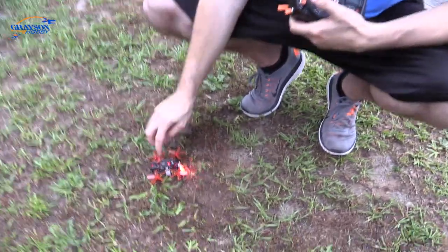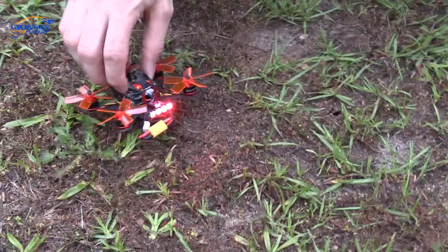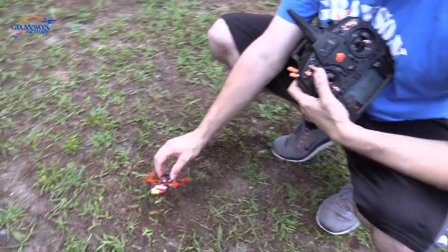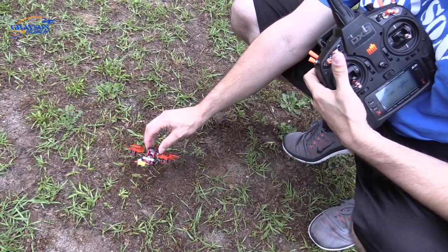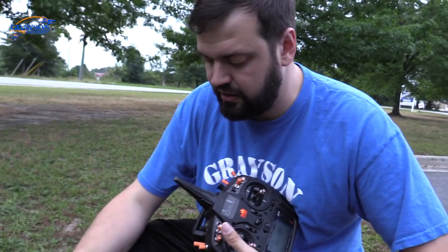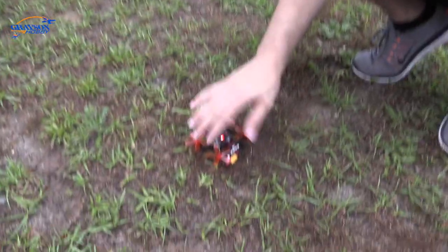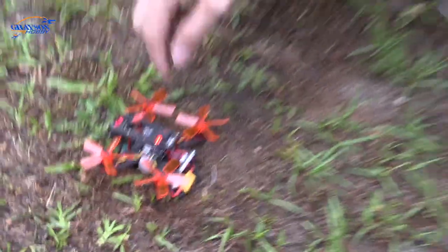I do have my LEDs on a switch — set up on AUX3. I have my LEDs turned off for flying generally so you're not putting extra strain on your BEC, especially if your battery's starting to get low. I am running these five-blade props but I don't recommend them — the motor and battery get a little hot with them. I just wanted to try them since we were out of regular props.